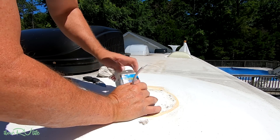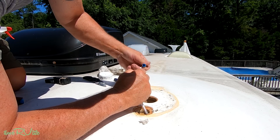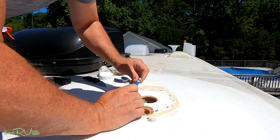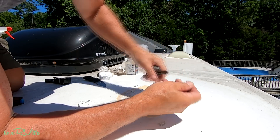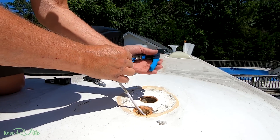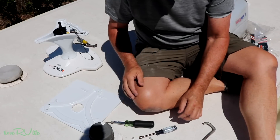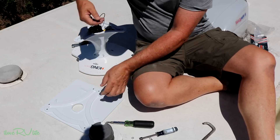These are RG6 connectors — this type right here. They slip on like so. That white dielectric needs to go right to the base of the inside — that's very important. Take a pair of clippers and cut this almost flush. Here's the tool specifically designed for this connector — that provides a water-tight connection. I will promise you, you could almost swing from the trees with that. That works out great.